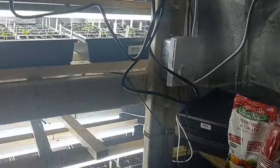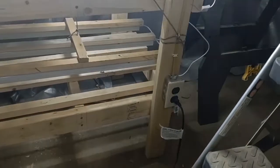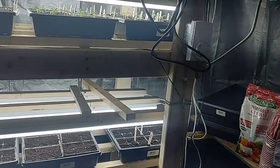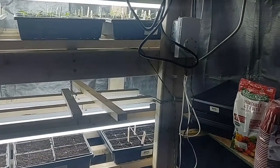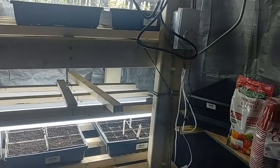I added electric right onto the grow shelf and wired that straight into my panel, because I've got enough loads plugged in that I didn't want to trip any breakers. Extension cords can get hot — most are small wire like number 18 and can't handle a huge load.